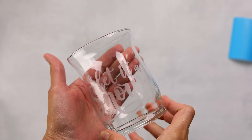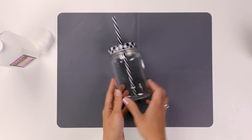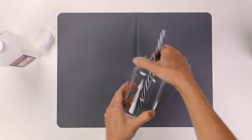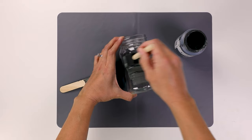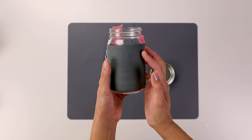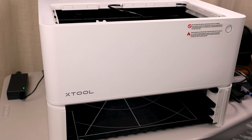You might remember when I used a Cricut to etch glass in a prior video. I wanted to see how the M1 stacked up using the engraving function and this cute glass tumbler that I picked up at Dollar Tree. Since the M1 is a diode laser, the laser would go right through the glass. For that reason, I'm applying a few coats of chalk paint so that the laser will be able to read the surface. Since this is a cylindrical object, we're going to have to use the rotary. With the rotary tool, you'll definitely need either the wooden risers that come with Xtool or the riser base — you need to lift up the M1 so that it has enough room to rotate and fit the tumbler underneath.